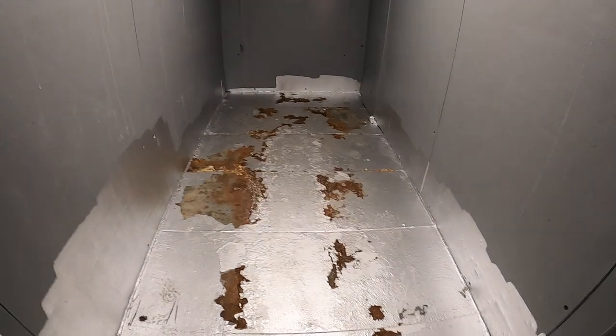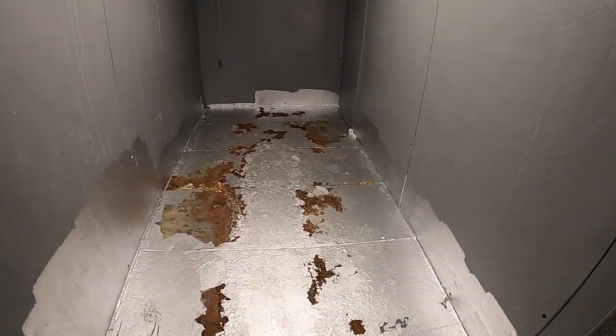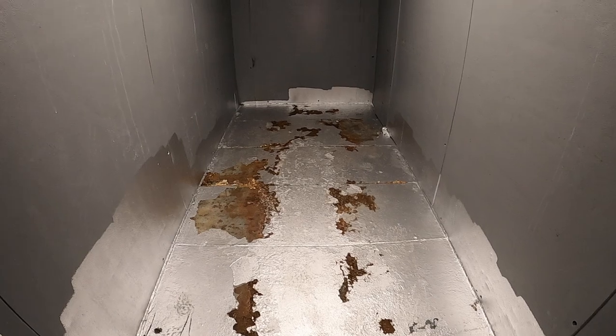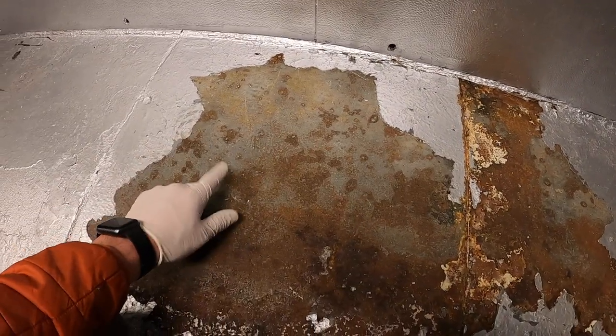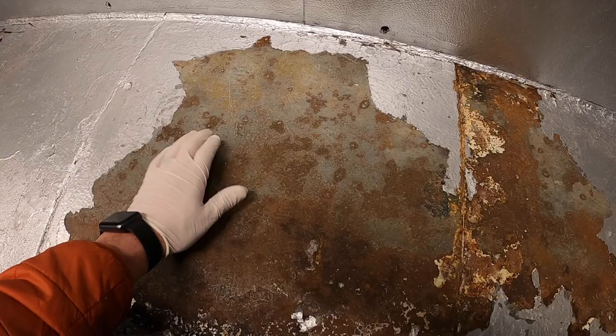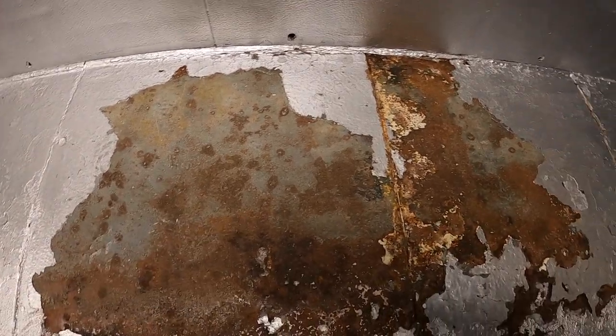Day two. After a coat of primer — some people are going to call me crazy — I actually put on a light coat on purpose. It's a little wasteful, but it's nice because it bubbles out, so the places that needed contact or scraping bubbled up in the paint. When you scrape off, this new paint will actually stick to the old paint, so everything comes up together. We went through and scraped it all, gave it another vacuum, and now we're going to do our second coat.